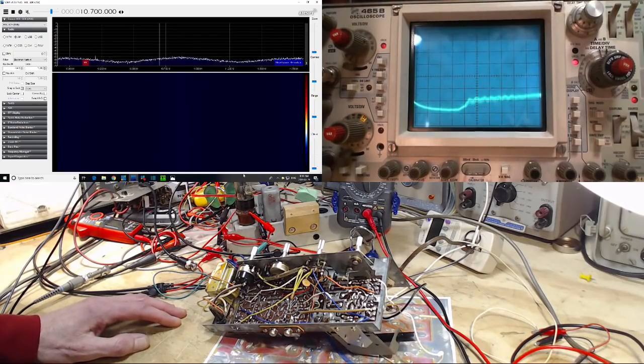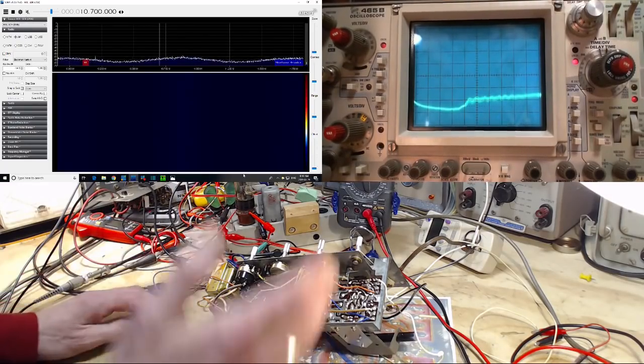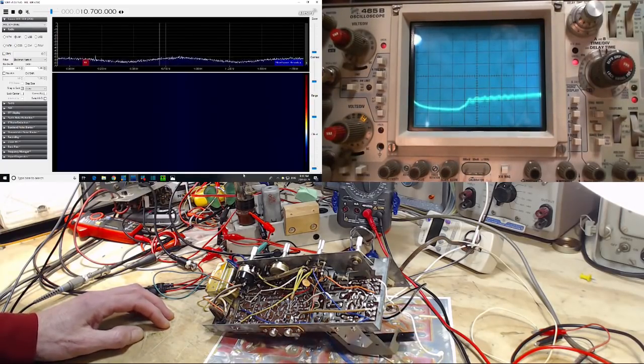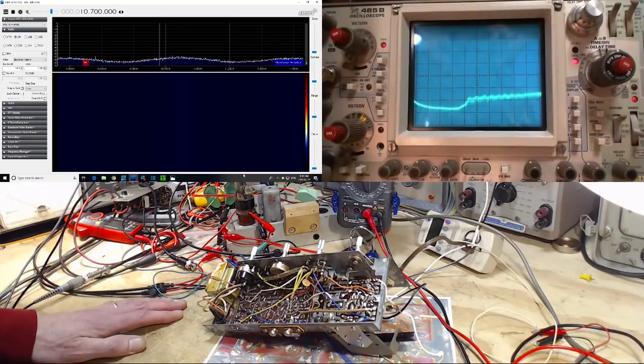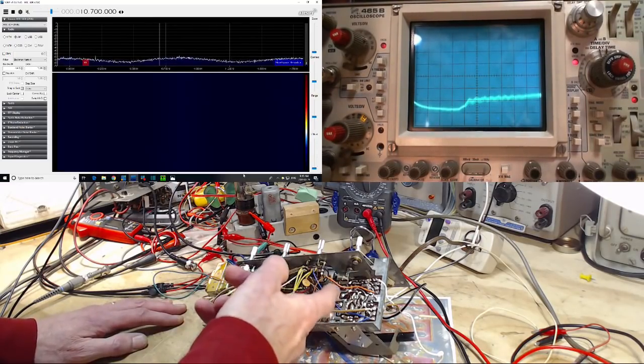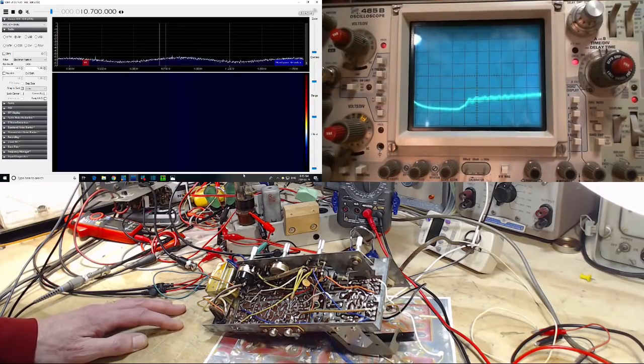Now, I have to talk a little bit before I get going on the radio. There's a couple hours of work here between the end of the last video and right now that I did on this radio, poking around, doing tests and all kinds of stuff. I videoed the whole thing, but I won't be posting any of that because ultimately the message I got out of all that effort is pretty clear. And here's the message. The local oscillator is not working in this radio.